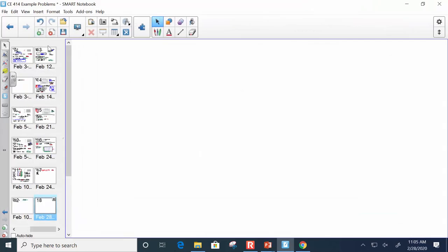I'm just going to dig right into it. So always, with one of these problems, we need to determine our factored load. So Pu is 1.2 dead plus 1.6 live, so 1.2 times 65 kips plus 1.6 times 115. Has everybody brought with them their AISC 15th edition Steel Construction Manual? That's 262 kips. You don't need the manual for that, but you do need it for what's coming.